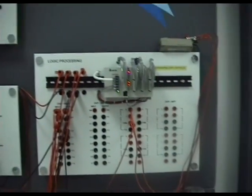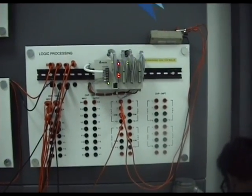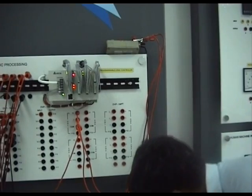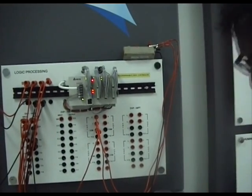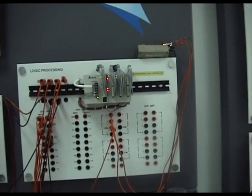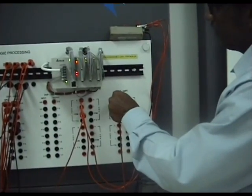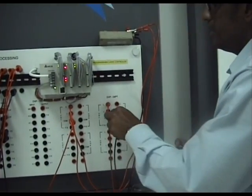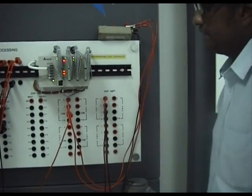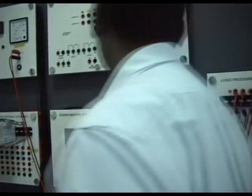I have a PT-100 sensor here. It reads PT-100, with a range up to 200 degrees centigrade — PT-100s come in different ranges. It is a three-terminal device: A, B, and B. I'm going to connect A to L+, B to L-, and the other B to I+.